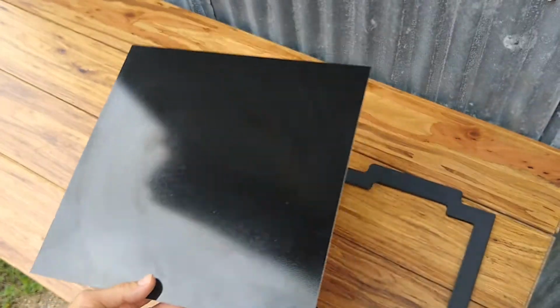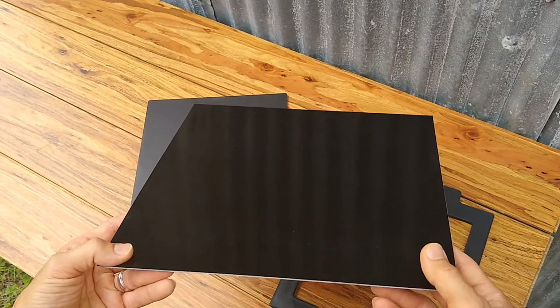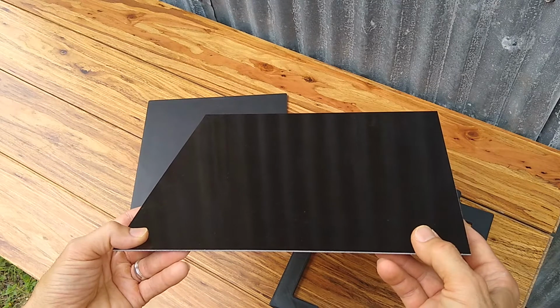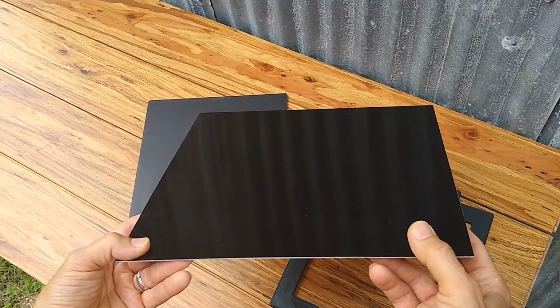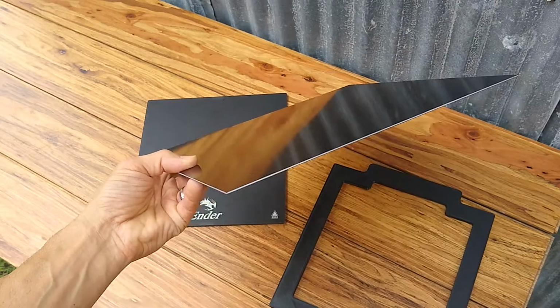the blade extremely quick. So what they have for these materials as far as cutting them goes, you can either get something that is diamond particles on it or tungsten carbide. Those are two materials that will cut Garolite, and that's what I'm going to use today.